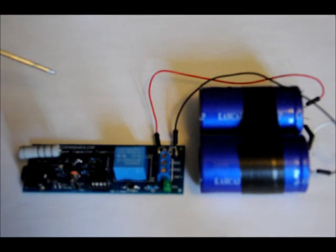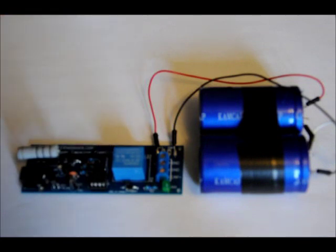This is my supercapacitor flashlight charger board, and two 400F 2.7V caps in series, giving me a series bank of 200F at 5.4V max. What I've done is modified the board so that it charges these caps to 3.75V instead of the typical 5.33V. Every time I plug it in, the relay will turn on, it will charge to 3.75V, and then it will turn off. It charges through a current-limiting resistor, and once the relay shuts off, there's no back-powering from the capacitors through the board. I'm quite happy about that aspect of the design.